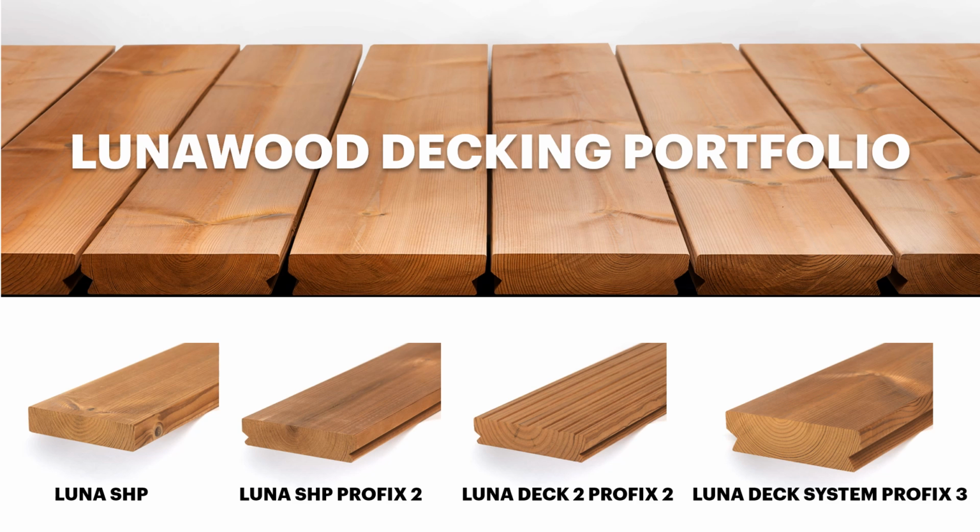Lunawood Thermowood decking portfolio offers a large variety of both pine and spruce decking products, and also different dimensions of decking boards with a minimum thickness of 26 millimeters. We have also different profiles available. Luna SHB planed round boards come in different widths and they need to be screwed on top. Luna SHB PROFIX 2 profile with smooth planed surface and LunaDeck 2 PROFIX 2 profile with modern grooved surface are available, for example, as 117 and 140 millimeters wide.